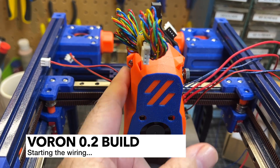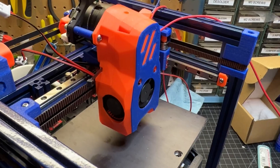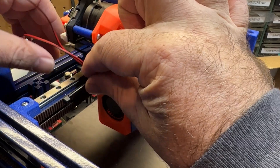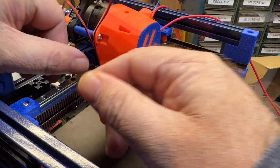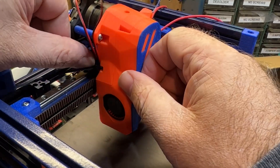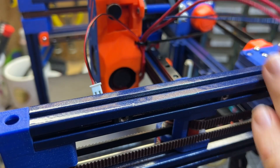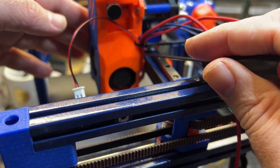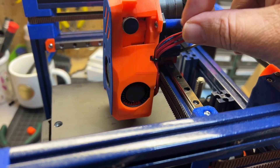Before I start connecting everything, I'm going to double-check which one is the hot end fan because I forgot to check that when I was wiring it. I'll go ahead and remove it and mark it. I'm going to use some zip ties to tidy up the wiring — luckily this tool head is pretty easy to remove, which is handy if you need to do maintenance. When tightening these down, be careful not to pull too hard because you don't want to break the plastic tab. Ideally, if you can tuck the wires in a little bit behind, that's where you want them — it won't hurt even if they touch the belts since they move with the tool head.